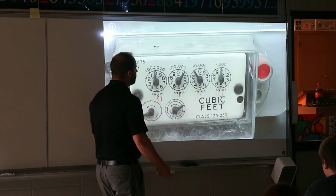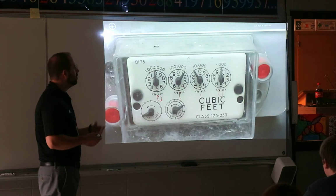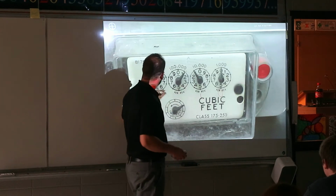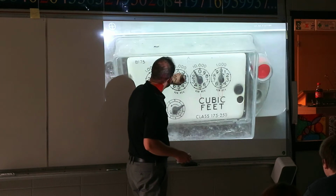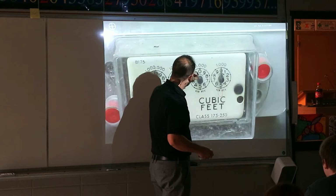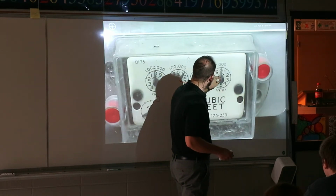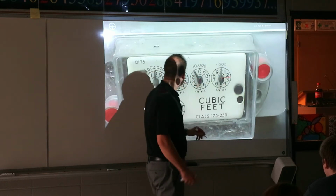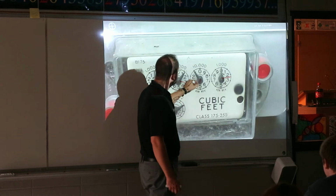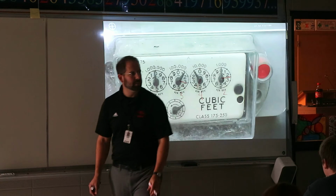And then what they do is, let's say this is January, because somehow it was reset to 0, maybe it's a new home. Then the next month, the next reading is this, where maybe the dial's at 3, the dial's at, let's say, 4, and then this meter is at, let's say, between 2 and 3. So that would be 0. If it's between 3 and 4, now it's 3. If it's between 4 and 5, it's 4. If it's between 2 and 3, it's a 2. You always pick the smaller of the two numbers.